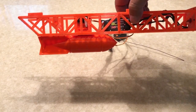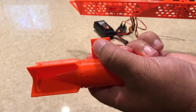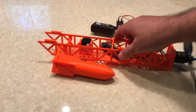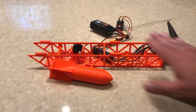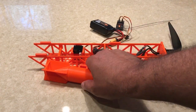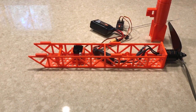When it comes time to release it, I activate the servo and it drops. You could use this connector design and attach it to anything — it doesn't need to be this bomb, obviously, so you could do pretty much anything you wanted to drop. It's printed out of PETG, so I'm not worried about warping in direct sunlight or on hot days. Feels like it should be plenty strong enough and relatively light.